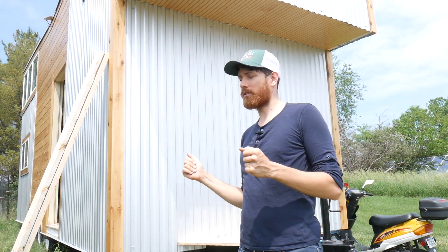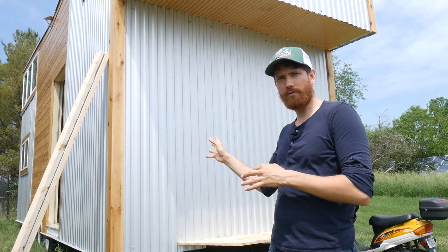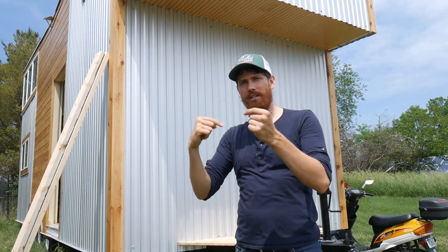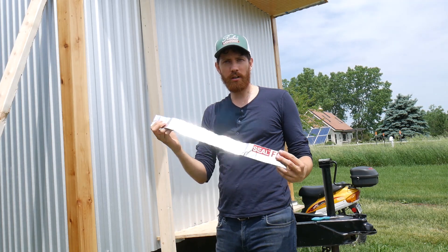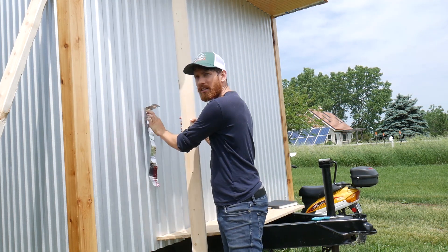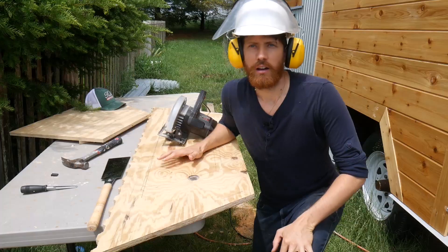If you've been following this build you know we've been doing metal studs to stay really light, but in this case I'm going to do wood studs. That's because I'm only using a few and I'm coming in at a lot of weird angles because of the 45-degree cuts I'm doing for turning radius. Wood makes more sense — it's harder to work metal studs at many different angles. I'm going to rip a lot of the studs into two-by-twos to save weight, and I'll use some extra window flashing tape with its rubber self-sealing membrane inside the groove so screws won't let water in.